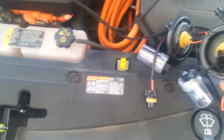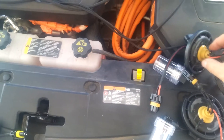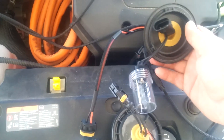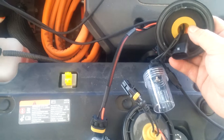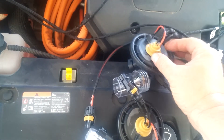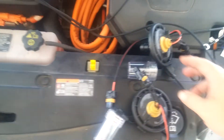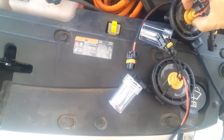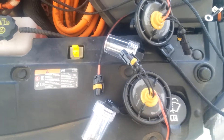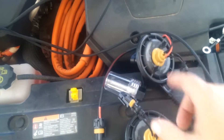I used a three-quarter inch diameter bit. First, I machined the tabs down and figured out how much clearance I needed. For these silicone grommets, a three-quarter inch bit works great. The people at Retrofit actually gave me a metric measurement of around 22 millimeters. I just measured the distance across the core and drilled a three-quarter inch hole. You can see my marks here because I used a bastard file and filed it all nice and flat so I could actually seal.